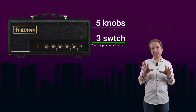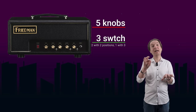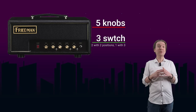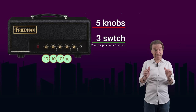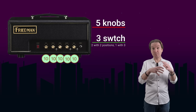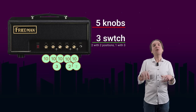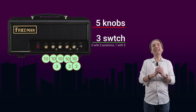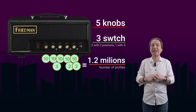Let's say that you want to profile 10 discrete settings of each knob, like knob at 0, knob at 10%, etc. Well, you would have 10 by 10 by 10 by 10 by 10 for profiling every combination of knobs, multiplied by 3, by 2 and by 2 again for the 3 switches and their positions. Well, we are obtaining a whopping 1.2 million profiles.